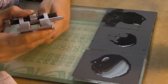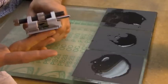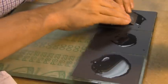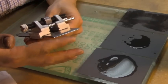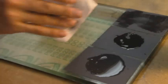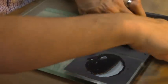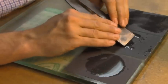The one thing I'm feeling for is a burr on the back. A burr is really important - it tells you that you've sharpened the bevel far enough that it's actually reached the back, and there's a little flap of metal sticking over. That's the way you know you've honed something as far as it needs to go. If you don't have the burr, you're not done honing yet and you need to keep going. After doing a lot more honing on the 800 grit, when I feel the back of the iron I feel a very, very slight burr. That tells me I've gone as far as I need to. Now I'm going to wipe off any leftover grit so I don't carry one grit to the next paper. Moving to the next paper, I'm going to put the back of the iron against it and rub it back and forth just a little bit - the point is to flip the burr back over to the front side so I can work it off with the new grit.